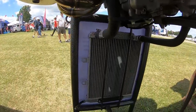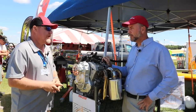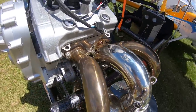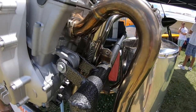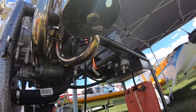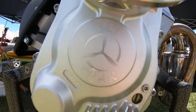It's not just the bolt pattern — the gear ratio itself is engine-specific. The ratios on each gearbox are based on how fast that engine turns, so the Phaser ratio is going to be around four-and-a-half to five-to-one, compared to the Rotax gearbox's 2.62-to-one range, because this engine turns faster. People think a four-stroke turns slower, but the actual crankshaft revolutions are quite fast — it may sound slower because it fires every other stroke rather than every stroke.